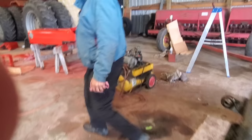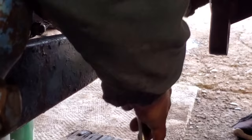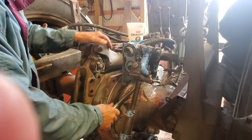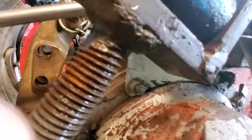If you want to come around to the back, we'll get a preset wrench and we're going to take the three-point hitch linkage off. There's a nut here that I'm going to remove. I also have to take these two bolts off to remove the hydraulic coupler so that it's out of the way of this bolt here.